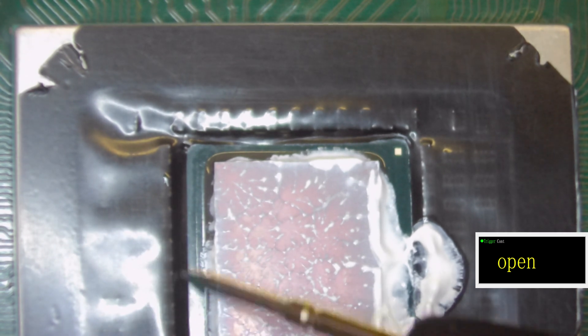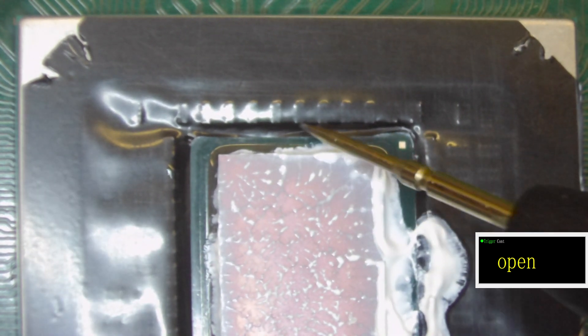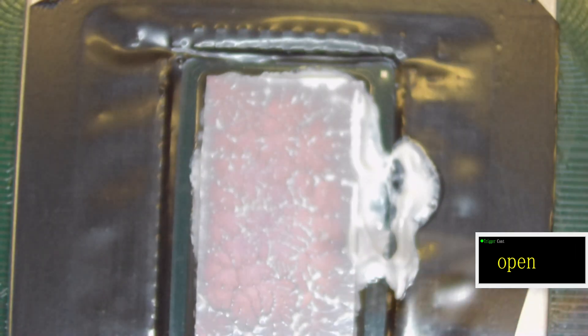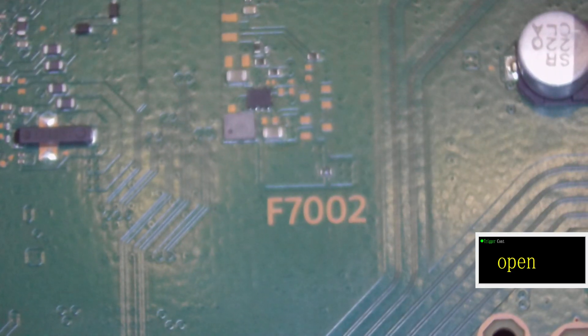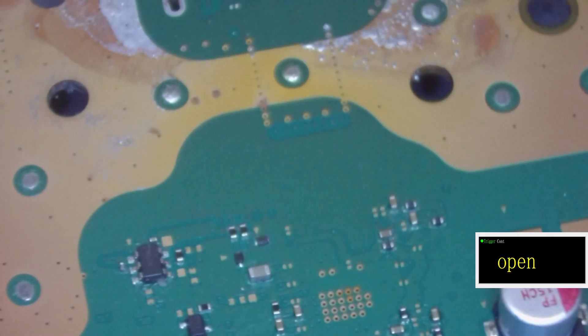Since the seal hasn't been split, I'm not going to peel it back. What I'll do is remove all of this thermal paste and install proper liquid metal. Then I'll replace fuse F7002, get the new HDMI port installed properly, and we'll come back and do a test.